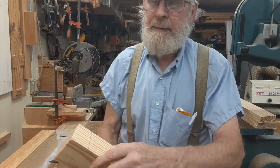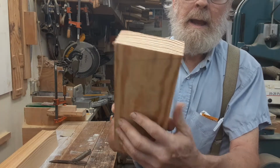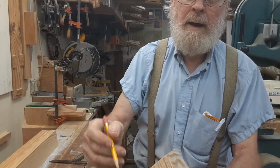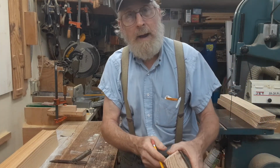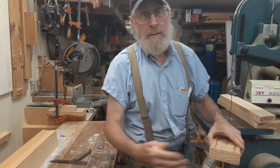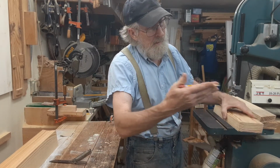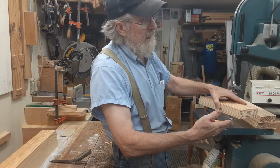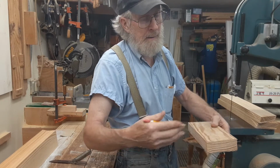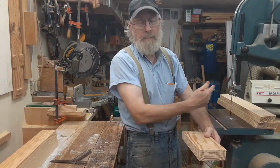So you got the 15, 15, 15. And that's how many lines you would draw if you're going to saw this by hand. You need to be following a line everywhere. Now I'm pretty sure you could cut this with a hand circular saw. You'd set it at 15 degrees this way, and just saw on that line right there, and you'd get that same cut. And you make that exact same cut at this end and this end of the board.